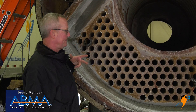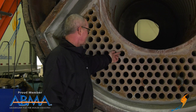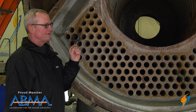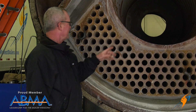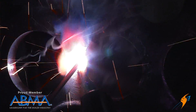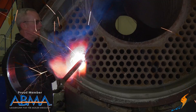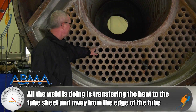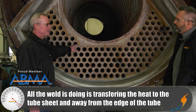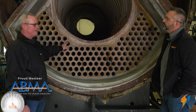To alleviate that, what they do is they stick this through — typically the thickness of the tube, or an eighth of an inch, not much more than that. They straight-roll it and then seal-weld it. That straight roll is what does the seal — we call it a seal weld. All that's doing is allowing you to transfer the heat from the edge of that tube to the tube sheet, so that it doesn't overheat and crack. That's all it's for.